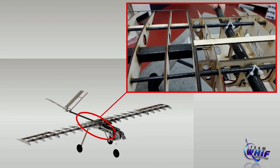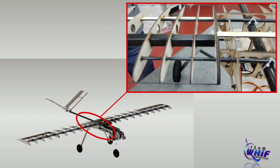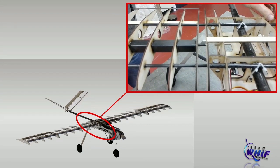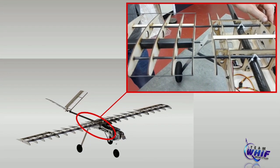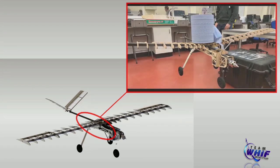The self-locking quick-release fasteners allow installation in just a few moments and in only two steps: insert the wing connector into the fuselage and then connect the electrical plug. This system allows a high modularity. For example, if the mission objective asks for a faster plane, another set of wings can be attached, optimized for higher speeds and lower payloads.